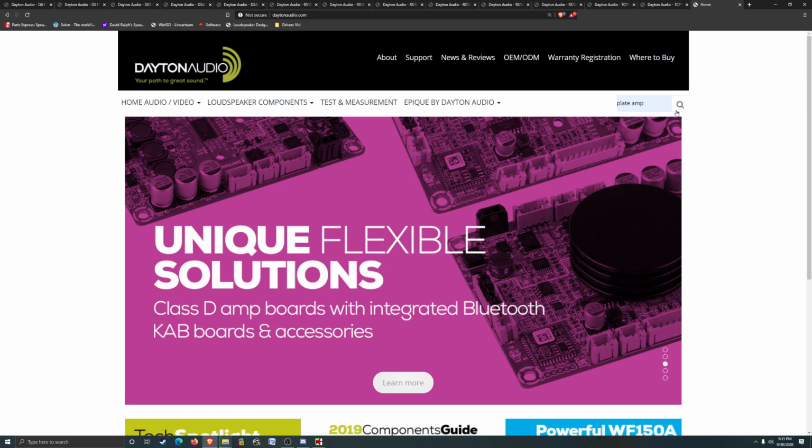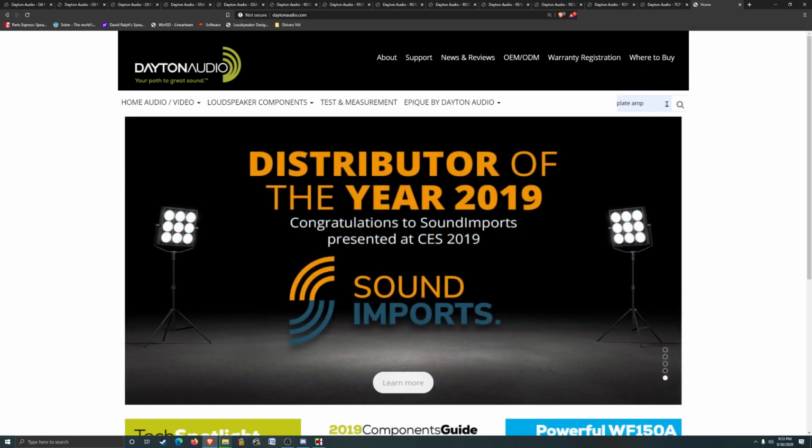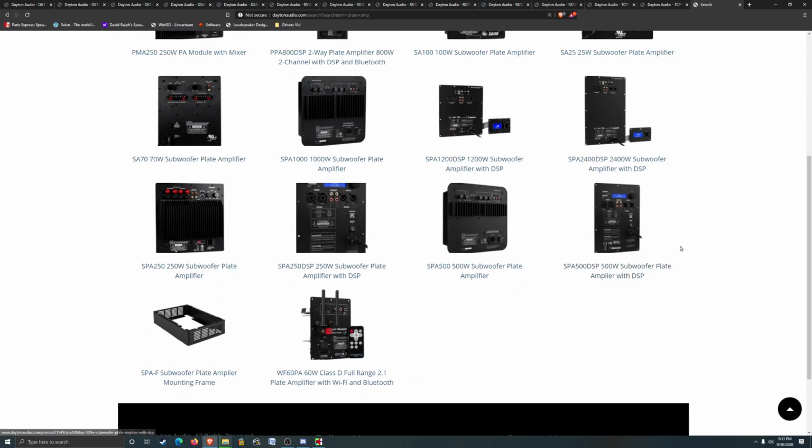Mixing the audio and the video together with HDMI is convenient, but also kind of sucks as far as technology goes, because if one thing doesn't support everything, then nothing works and it's instantly obsolete. Like the first gen of HDMI amps, they don't support 4K, they don't support 8K, they don't support HDR. Even if you paid $1,600 for the thing, it's ridiculous. Just a total waste of money. Meanwhile, it's got the right port on it, it just doesn't support the features. It's not really a pass-through, it's more of an extract.